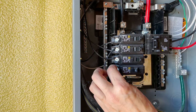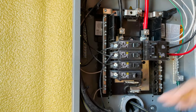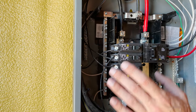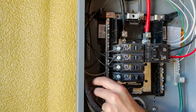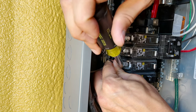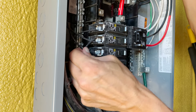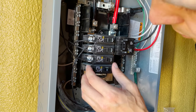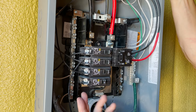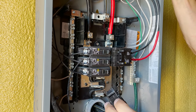I've found that most of the time it's easiest to put in your circuit breaker after you've run your wire — measure it out and give yourself lots and lots of room. Some of this panel was done by an electrician and some by me; I did some of these too short, which isn't very clean — this was actually one of the first panels I worked on. You want to give yourself plenty of space so you can put it in as necessary. You don't want it so tight that you risk snapping the plastic, but it should be snug. Almost every time I do it I give it a nice little tug to make sure it's actually in, then do a visual inspection to confirm there's enough contact.